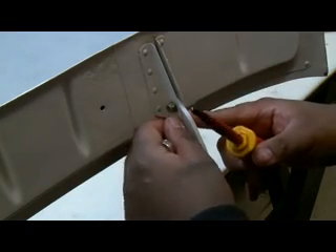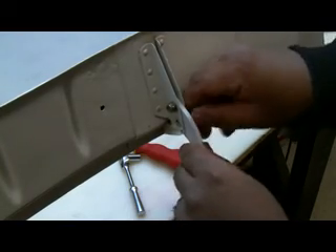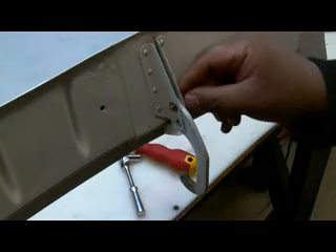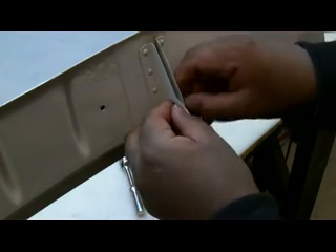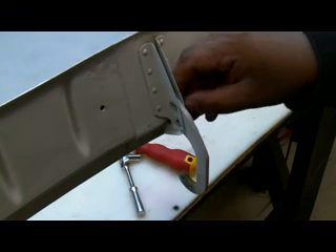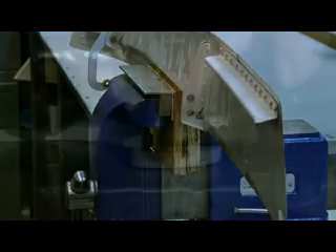With the steel bearing clamped between the structural members, any wear in the joint is going to be in the soft hinge arm. With our kit we will eliminate the possibility of this happening again by taking the hinge arm bore out to a slightly larger clean diameter suitable for the AeroTough Grease-Free Bushing.